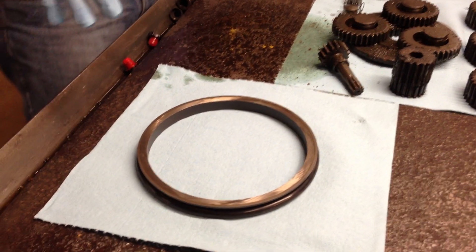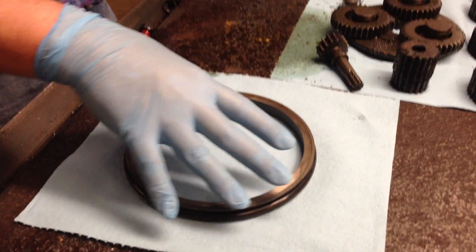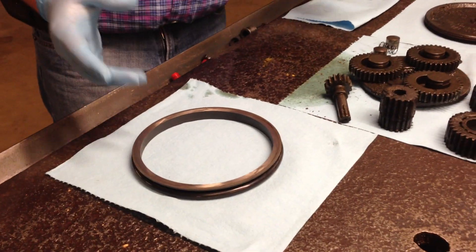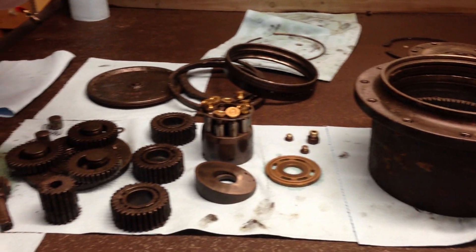What that happens from is just these seals are hour rated. You might be over your hours, or you might have been going through some sludge, some real boggy stuff, and got some dirt and stuff slammed into where the seal area is, causing it to offset the seal.